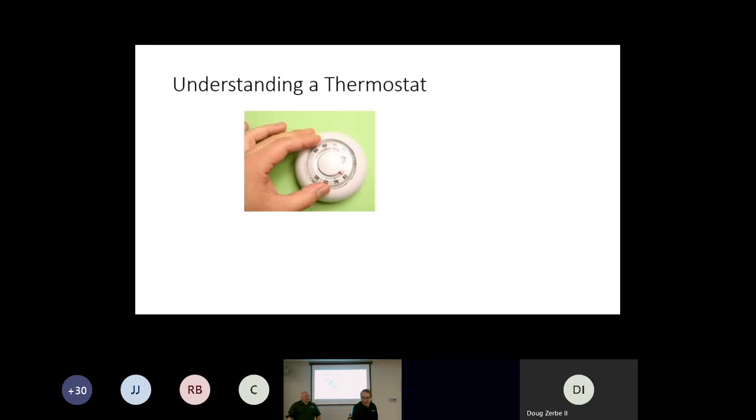The only thing that I would say is this, guys. You all have known that when you braze, you put a piece in and you start to heat it up, you will watch there's movement. When you're using these Smart Lock fittings, mechanical fittings, you cannot have stress on that line where it's going to want to pull out. You can't shove it that little bit or have somebody hold this end while you do this. Without any tension on that, you would slide this over. You have to seat your pipe, making sure that it's a nice flush, flat cut in there, and you hold that, and then you start tightening up because it's going to want to walk. Well, if there's tension already on it and we're pulling on that, eventually we're going to set ourselves up for a blow-off failure.